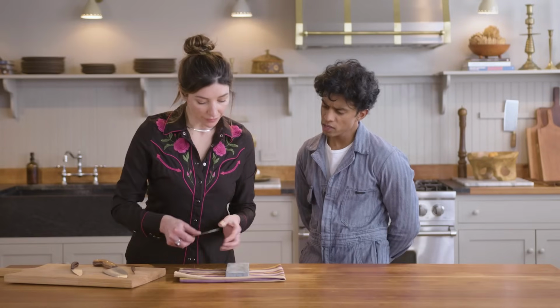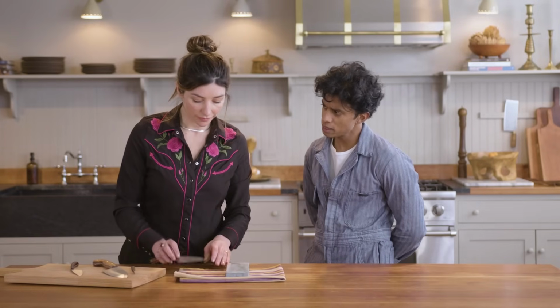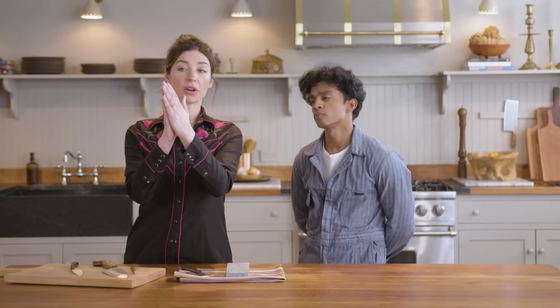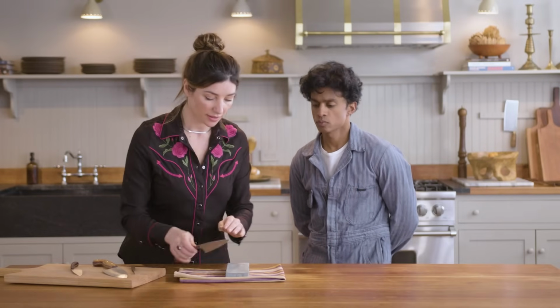So when you feel the catch, what you're doing now is trying to eliminate the catch by grinding it off. What I'm trying to do is, if it's turned this way, come at it from the other direction so it pushes it over the other side. And then as you go back and forth on each side of the blade, you create what's called a burr. It creates a burr along the edge of the blade that curls to one side, and when you switch, it curls to the other side. And you do that repetitively until you eliminate it. You work it enough so it's eliminated.